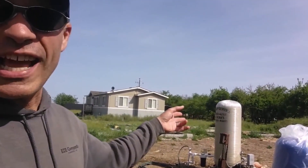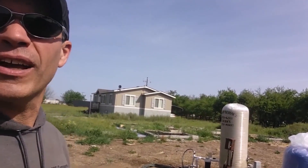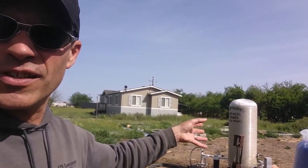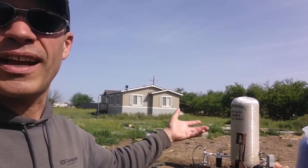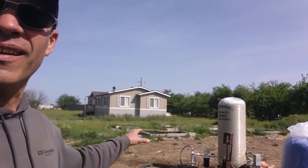At your own risk, but if you're interested come along. This is a case where a fiberglass wrap tank has been here for about 15 years, out in the sun in the Northern California Valley, and eventually it cracked — the top is leaking all the air out. This is a conventional air-charged pump system, and the crack in the top of the tank was letting all the air out, so the pump would cycle too quickly and burn out the controller. We're going to put in a bladder-type system instead.